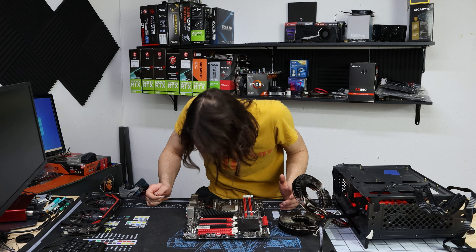This thing just got out of the dishwasher. It is absolutely gorgeous on every surface except for some minor corrosion around some pins and surface capacitors. So I'm going to go ahead and clean it up some more with a toothbrush, maybe some Q-tips and alcohol. I've got a fancy toothbrush — an ultrasonic toothbrush — and that works so much better for this.